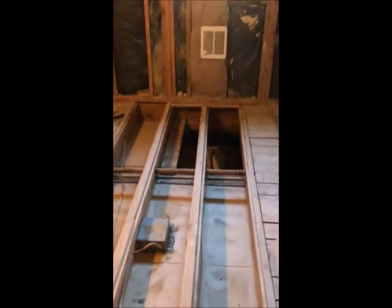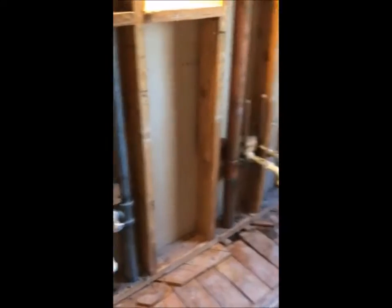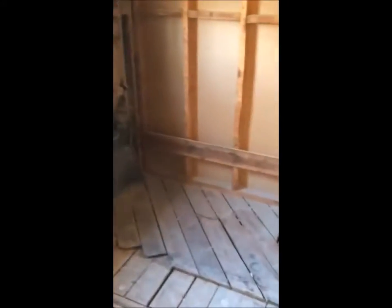Phase one demolition complete. Gotta watch our step. There's the plumbing for the old vanities — it's gonna stay right where it's at. We're gonna do some vanity lights above those, some recessed lighting as well with an exhaust fan, which was currently not something they had. We got rid of the old metal tub as well as the tile.